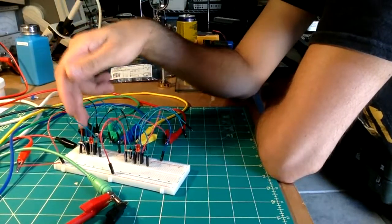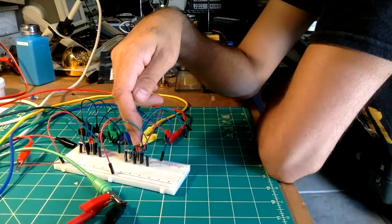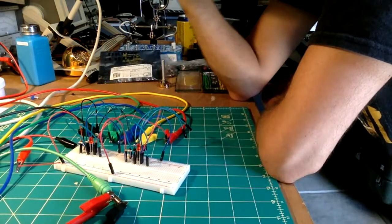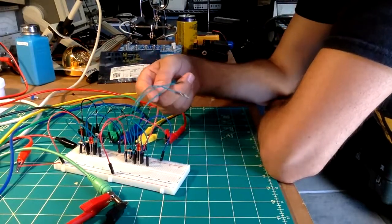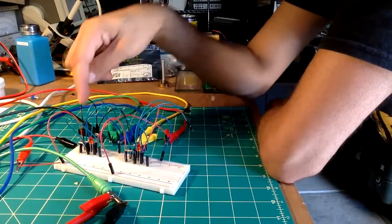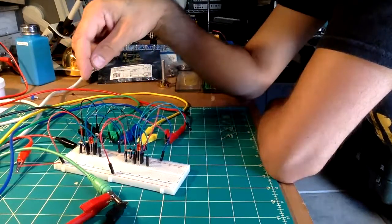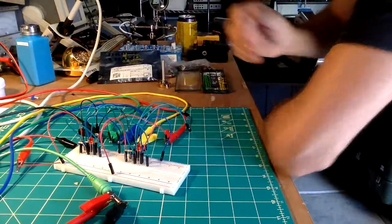Make sure that I didn't break something on the first oscillator, and then try and figure out how to include oscillator 2 into the mix. So as it stands right now, none of the output connectors that are supposed to go to a potentiometer are connected. The potentiometer for oscillator 1 is routed and the oscillator works fine. So let's hear that real fast.